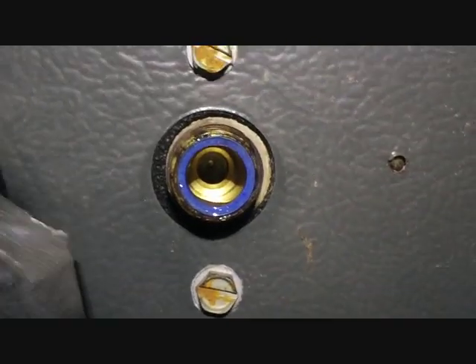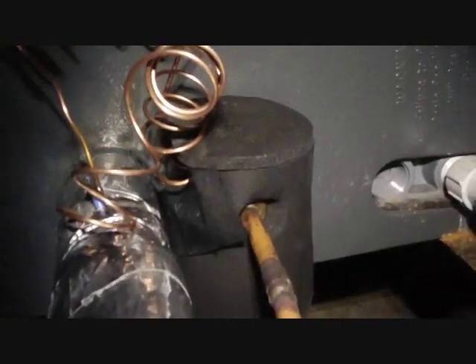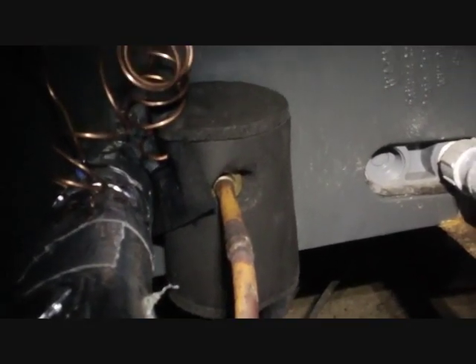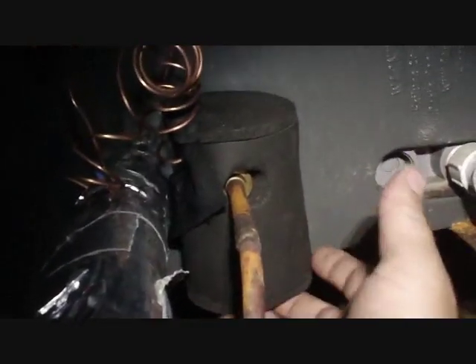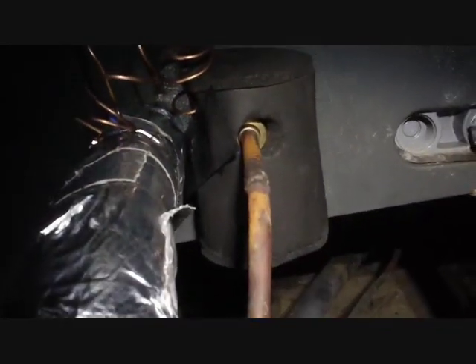These things wear out over time. Compression fittings are a real pain because it's only a matter of time before they'll leak. Maybe we can add years onto it with this stuff. Alright, our TXV is back on, our little housing is in place to keep it from sweating as badly — I don't know how well it really works, probably not great. We're going to pressure check it now and then move on to vacuum if everything's okay.